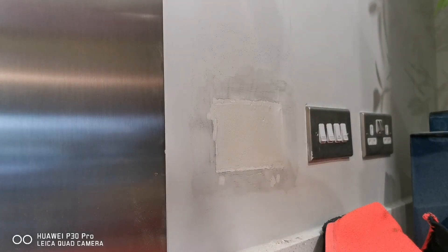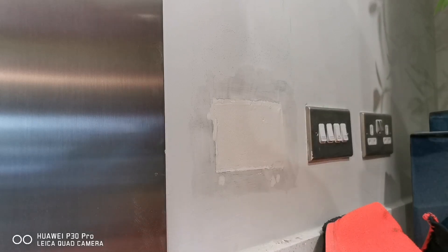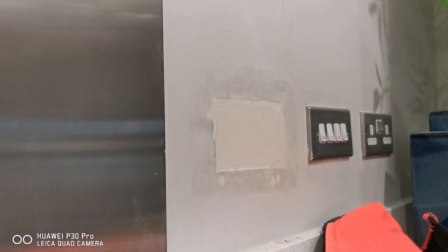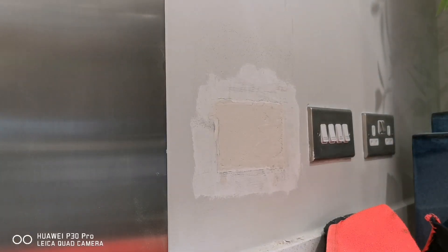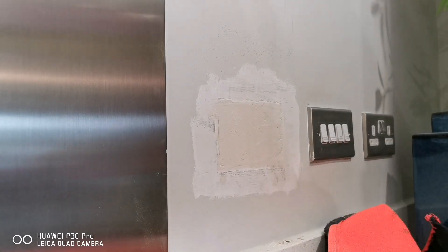You need that to pick up — what you'll find is it's going to suck in as it dries, going into the plasterboard a little bit further. The second coat will fill it out. As you can see, we've let our first coat dry and it's sucked in a little bit.